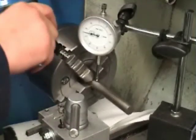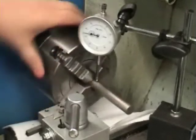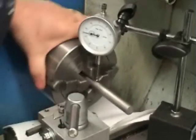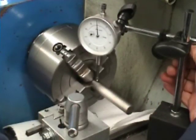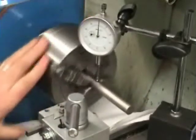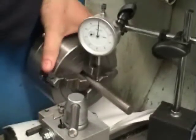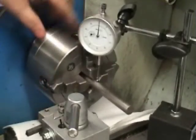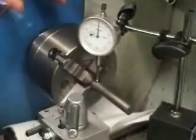Before again — you may get some imperfections in the bar itself — but I'll zero this so you can see exactly. A little bit clearer on what we've got: that's one thousandth coming back, so there's a thousandth of an inch there. We'll tighten that one just a fraction more if we can get it.